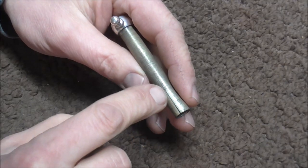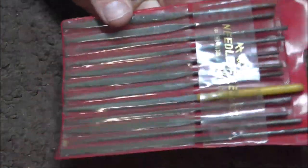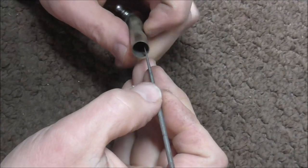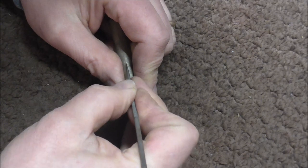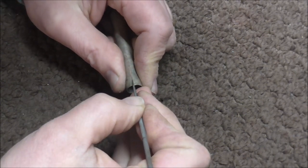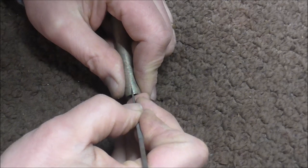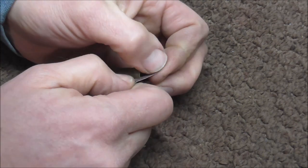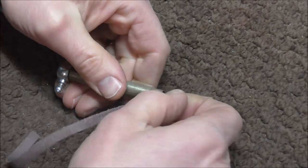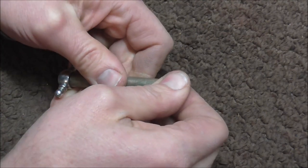What I am going to do is silver solder in this crack. For solder to stick to anything, it needs to have a clean surface. So I am going to take some of my needle files — the smallest, pointiest one right there — and that is going to clean up inside of the crack. I am going to file the crack so that the solder will stick to it where I am filing, because the filing takes off the old metal and the old oxidation and leaves clean metal behind. Then the solder is going to stick to the clean metal. I am also going to use a small piece of sandpaper to get right in between the crack. I do not want to spread the tubing apart farther than it already is, because that can cause problems too.